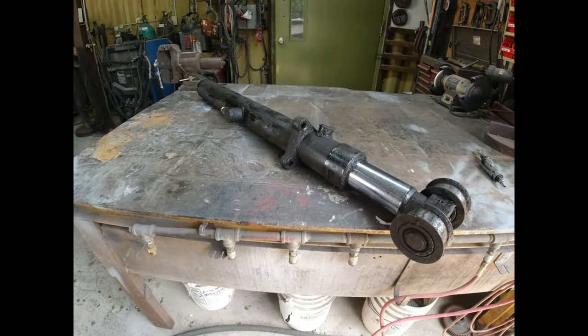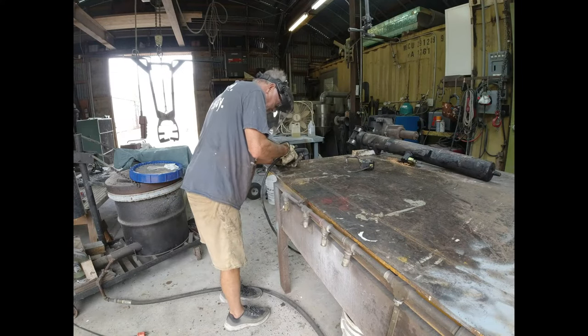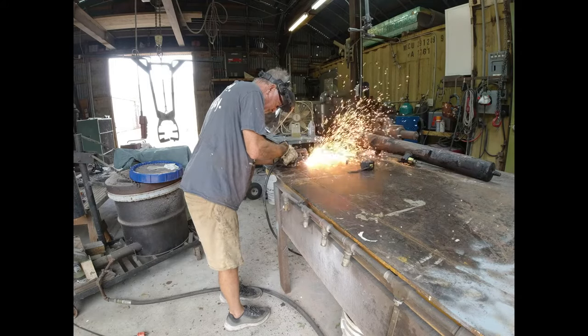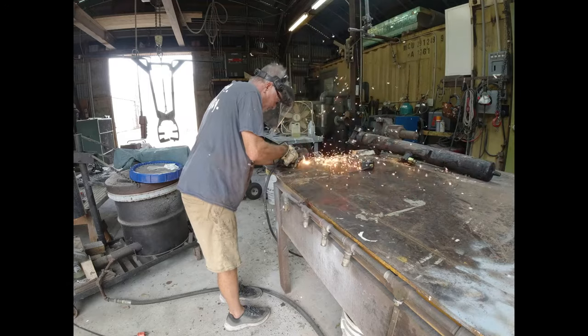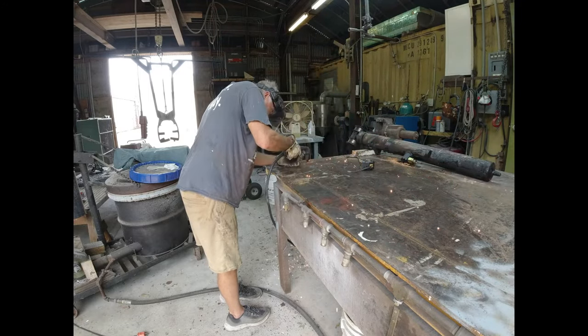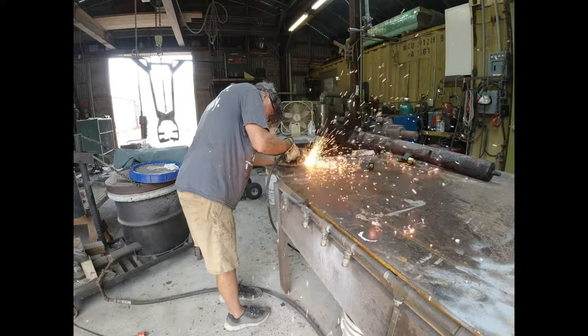First I've got to get the grease off my neck. I was trying to burn a bolt hole in my table with my plasma torch and didn't have any luck - I think I had so much spatter I cooked my tip, and I didn't have another one. So I put the plasma torch away and pulled out the old magnetic drill, and the magnetic drill did the trick.